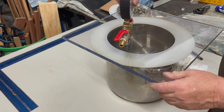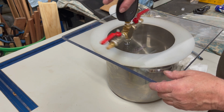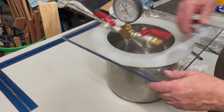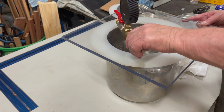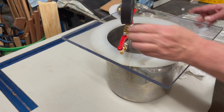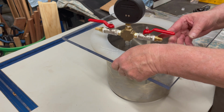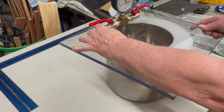It's time to assemble the parts. I've used Teflon tape on all of the joints except the bottom thread that screws into the top. All of the parts have been tightened except the bottom connector, which I've left just finger tight. This way, when I screw the parts into the top, both of these threads will tighten evenly, giving a better feel for tightness and the ability to have the dial facing in the desired direction.